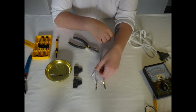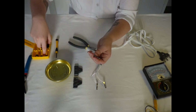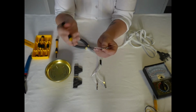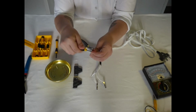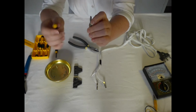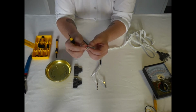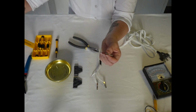Once you have your prepared copper end, you'll need to put the prong on. Take it off the trimmed end by unscrewing the retaining screw, this small one right in the base here, and pulling out the old wire. This should only take a turn or two so that the retaining screw doesn't come out. You can see that it's now about halfway out. It's possible to put it back in if it does fall out, of course, but there's no need to make our lives more difficult than they need to be. Take out the end of your old wire and you can just throw that away.